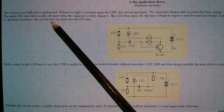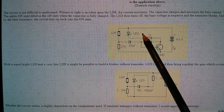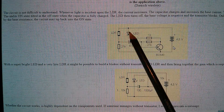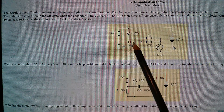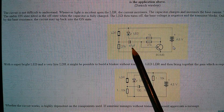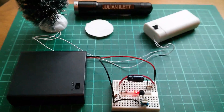It says the circuit is not difficult to understand, but I am having a little bit of trouble. When the LED is on, the LDR will have a low resistance, meaning this point will pull up — and so will the other side of the capacitor, because instantaneously both sides do the same thing. Then the negative side of the cap will drift down, and at some point the transistor will turn off, the LED will go off, and the LDR will go high resistance. This point on the positive side of the capacitor will shoot way down, and the other side could potentially go below zero, but that's not permitted because of the current path back through there. Then the right-hand side of the capacitor will have to drift up and turn the transistor back on again. I'm not sure it's that easy to understand, but it certainly works.